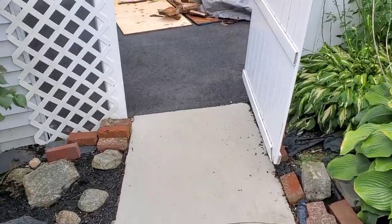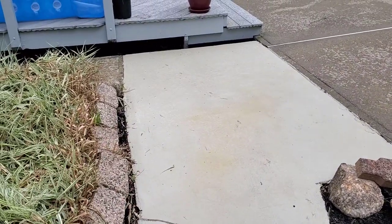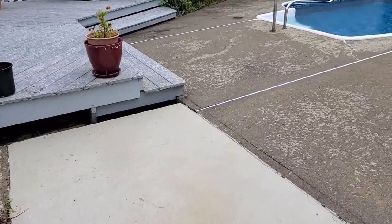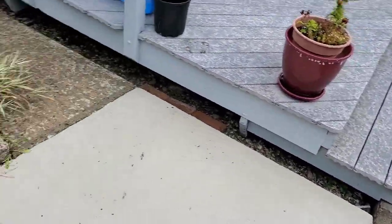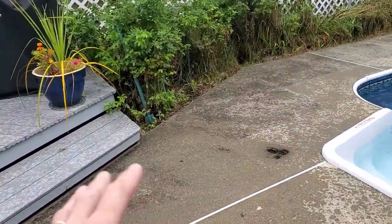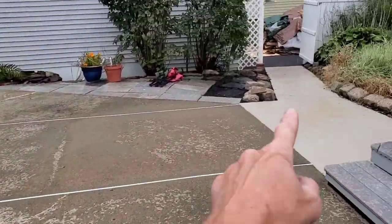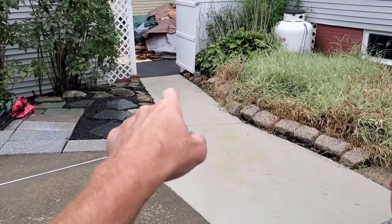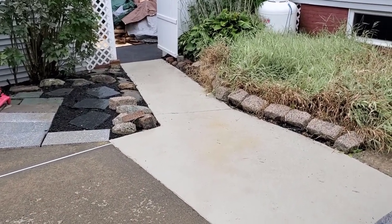This was all like deteriorating — we patched all this, cut those joints back in where they were, and it's still holding up really really good. So it was definitely worth the money just to do the patch rather than rip it all out. Now we're here to resurface the pool deck with the same product we used to resurface this with — color it, prep it today. It's raining right now but that's okay — we're going to pressure wash it, clean it, get all the mold and mildew off it, and use the same resurfacing product we used on the walkway. That stuff really works — the process we use really works to repair that — and two years later it's still holding up like the day we did it.